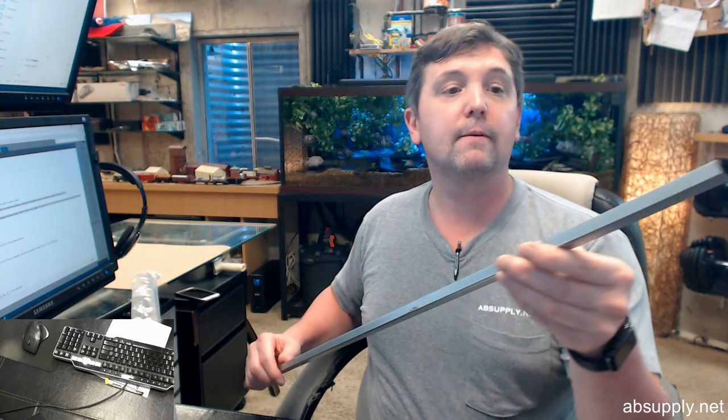Now, when used on the hinge side of the door is where you're going to use this piece. It would be attached to the jamb, as the drawing shows. You would have a slot cut in the stile of the door, and that's where the hemmed over area would fit into. If you have a double door, you would use this on both hinge sides. I have also seen these installed simply as two nested hooks together where they've got a rabbet done in the meeting stile of two doors. And that would be appropriate.